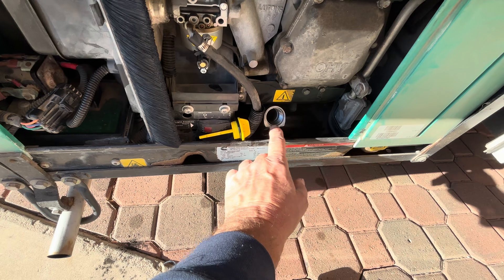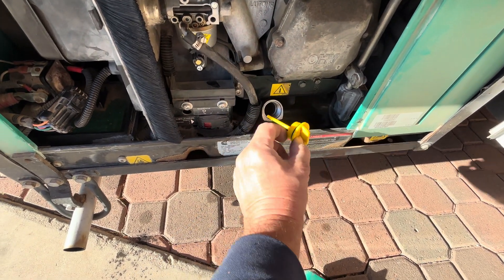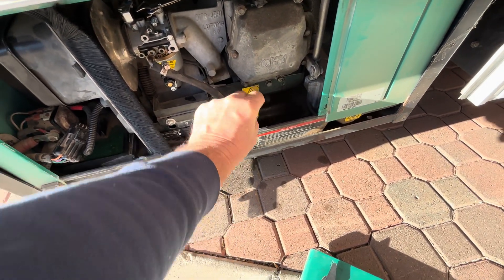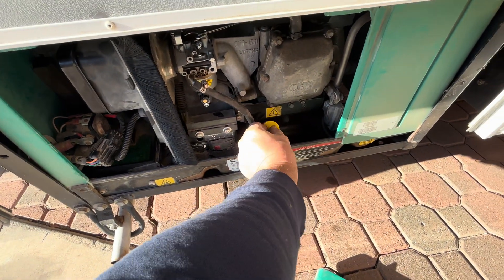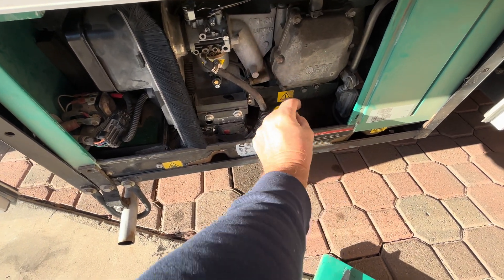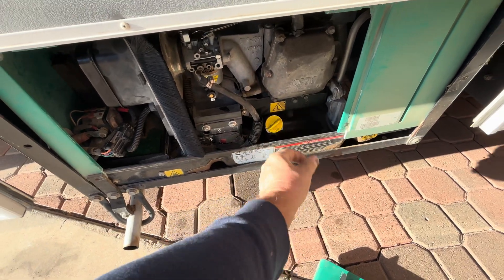The problem is once the oil gets hot, it expands. If it's at the lower end it can expand all the way up. If you're at the halfway mark, you'll go above the full level. Right now with hot oil, it's just starting to come into the threads — that's an inch and a quarter from the top down to the threads. I had it at about a quarter inch below that and it's running great. After the engine oil got hot, it rose up probably just over half an inch. That lesson can save you hours of having to mess with this.